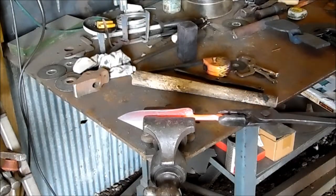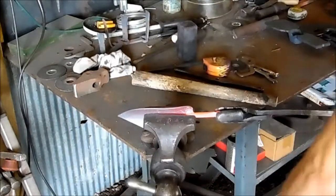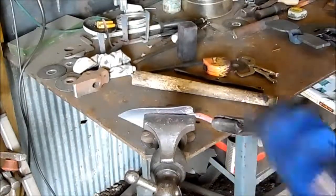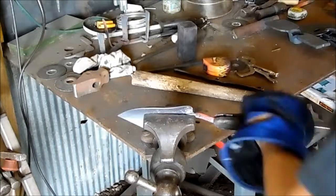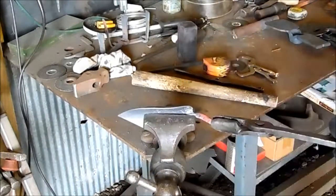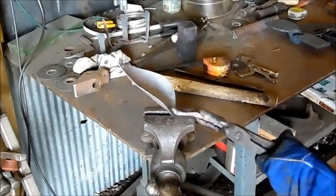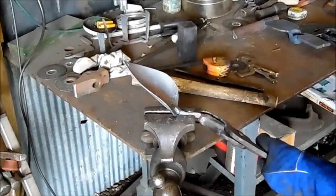Using our same heat that we cupped it with, we're going to move quickly into the vise and bend the shank. This gives you that little bit of offset you need to keep your hand working up above the soil level and make it a very effective digging tool.